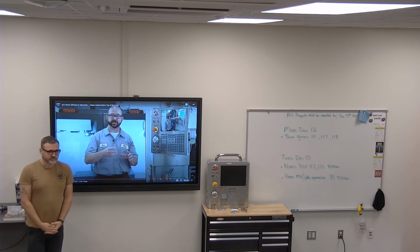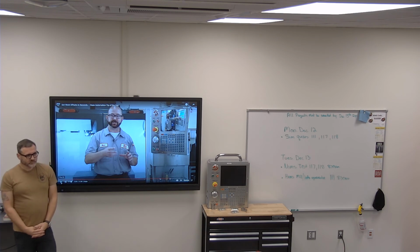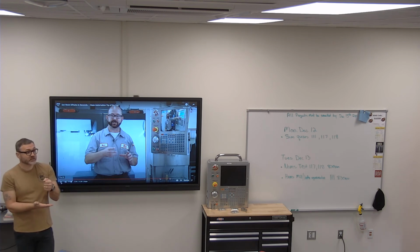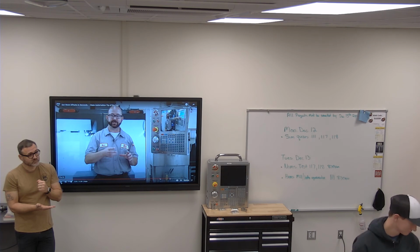You're telling Z to hover, you don't want to go all the way down, you want to tell it to come down. I'm going to start slightly above it and I'm going to probe down to it. So let's just say I'm going to start at about a half inch above it. And I'm going to say I want to go down at least 600 thousandths to hit the part. It's going to go down till it hits the part and then do a hard hit, soft hit.